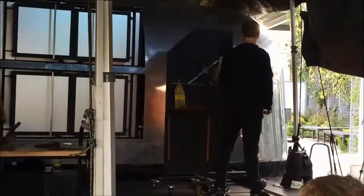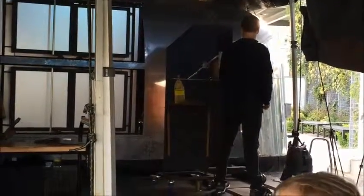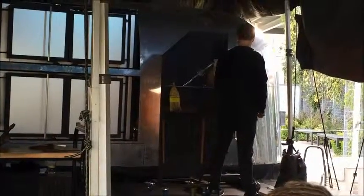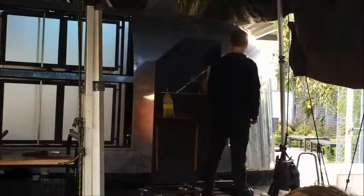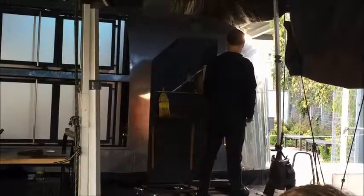So like I mentioned, he's having to manage the heat at both the top and the bottom of the piece. He makes sure that as he approaches that reheating chamber, he gives the vessel something that we call a flash. And the flash is just a maintenance heat. It keeps the piece attached to that punty rod.